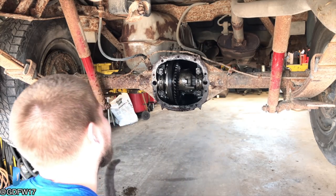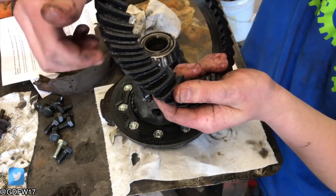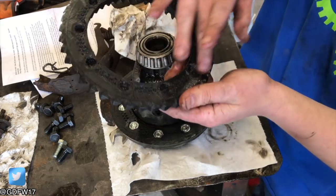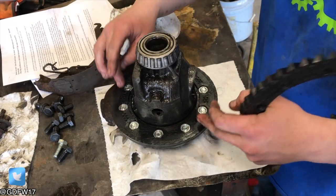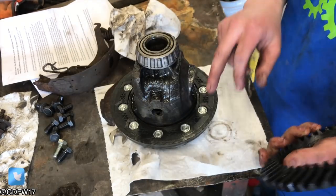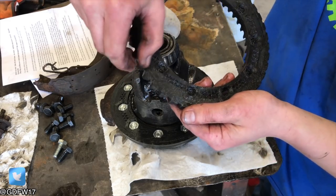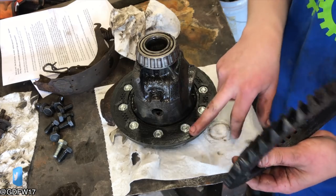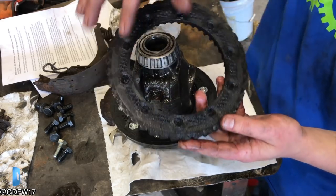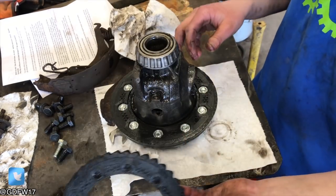Here's the carnage. The pinion gear pushed my plastic where my model was a little off, but everywhere else the gear teeth look pretty good. The real problem was twofold: first, pausing at 17 millimeters to insert the bolts allowed the part to cool, so that layer didn't adhere well. Second, when I put it back on the build plate, that layer wasn't fully compressed as it should have been. So we're going to try JB Welding it back together and get all this oil off first.